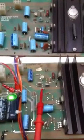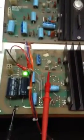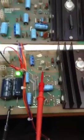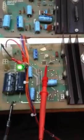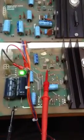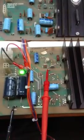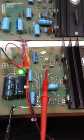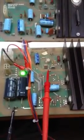The sense lines cause overvoltage normally because the edge connector to your game is bad — it's old, it's sprung, and it's just not making good contact. A lot of times you can clean up the edge connector or the board fingers and it'll cure that problem. Best to just replace the edge connector, and personally I don't do the sense mod — I remove the sense lines altogether.